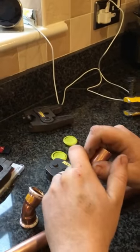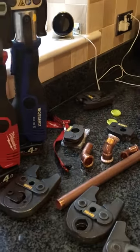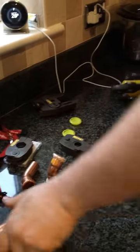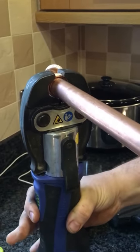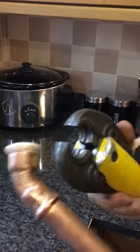I'll go back to the guns now and show you how to press and explain why I prefer the Nova Press over the Mini Press. We're going to press 22mm gas pipe on the 22mm pipe. You've got a depth marker which you line up, make a little mark, push the fitting on, and then press it. Things I like about the Nova Press: you don't actually have to hold the button down for it to fully press. If it's in a tight spot or awkward, you just hold it for a couple of seconds and let go. That's the cycle done. The REMS Mini Press is a little bit more noisy, maybe not as smooth.